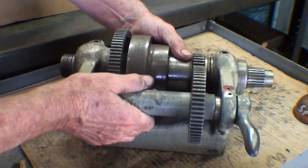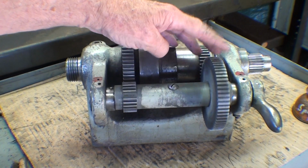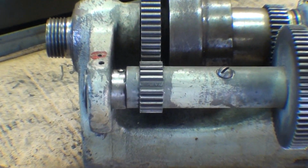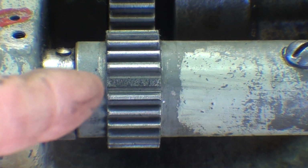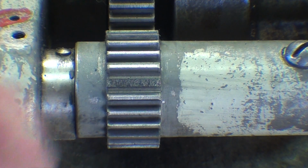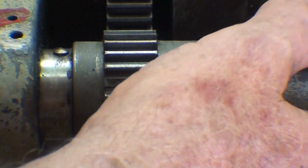The only major issue with this is the missing gear tooth. Now it may function in back gear semi-well with the missing tooth. We'll see, because I'm going to try to use it. However, under a great deal of torque or stress, maybe it would clunk or even strip the next gear. I really don't know. Time will tell. I would hate to damage the larger gear though.